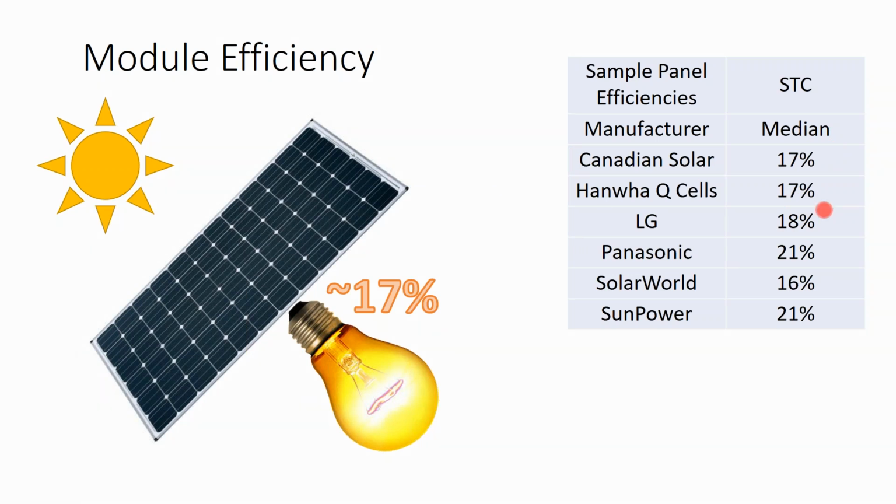If I'm in a low electricity market, if my electricity costs 11, 12 cents a kilowatt hour or even less, the higher efficiency modules are so expensive that they're going to ruin your economics. I'll sell high efficiency modules to customers, but that's like if they're the luxury car dealership owner and they don't really care about the system, they just want the best. I'll give them the best.